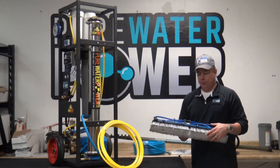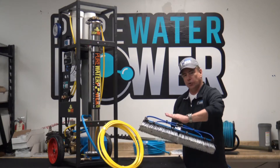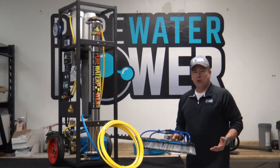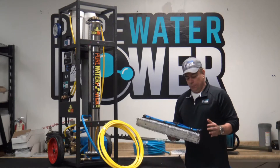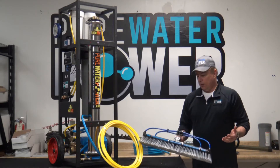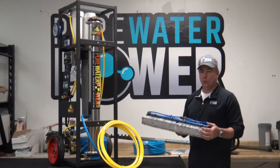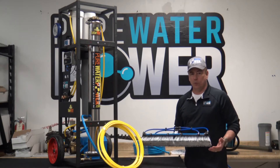This is a 24-inch brush equipped with a customized aluminum rinse bar that has pre-drilled holes to allow water to shoot over the brush, and it also has two bigger jets going through the brush for a complete optimal water source at the panel where you need a lot more water to clean your panels efficiently. Because of the bigger holes through the bar and the bigger jet sizes, this brush will not work efficiently with a regular RODI system that doesn't have a pump. You will need to run a booster pump anytime you're using a four-stage system to ensure that you have enough water at the source of the panel.